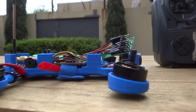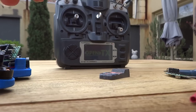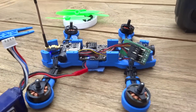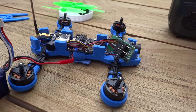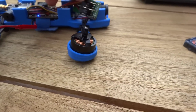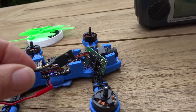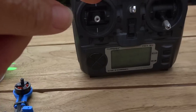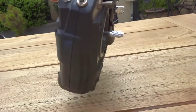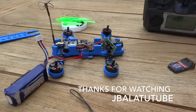If we turn this on now — obviously we're not in fail-safe anymore and we've got a solid red light. So all we have to do is apply the binding plug over the battery terminal, apply some power, and lock that transmitter in using the bind button on the back. It's fairly straightforward. Thank you for watching.